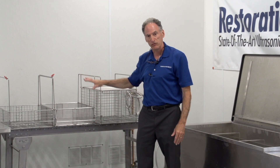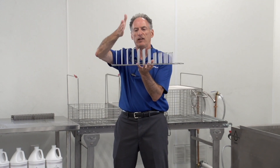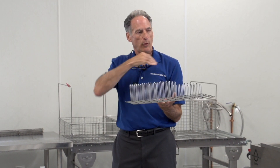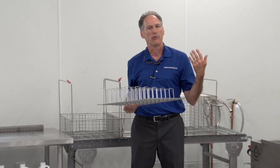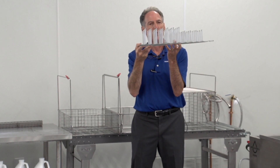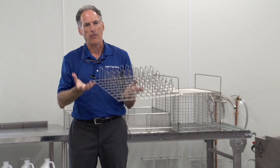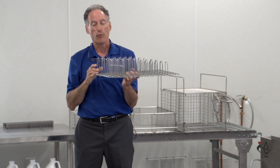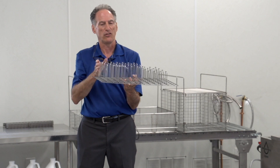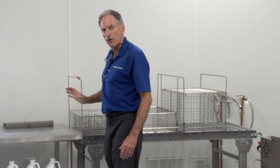Those are the three basic types of baskets. Some of the inserts that are possible — this is a dish rack insert. If you take a look, you'll notice it looks a lot like your dishwasher at home. It's a dish rack set designed to load dishes in. With an ultrasonic system, there's no need to have an external dishwasher — you can clean all your cups, dishes, and glasses in the ultrasonic process. However, this is not to be used with glasses standing upright. You'll want to lay the glass down, because as you lower a glass into the tank it'll fill with air and the glass will start to pop out or float. In order for ultrasound to work, you've got to get water into all the cavities. So this is perfect for dishes — just stack the dishes into the grooves. This dish rack set drops into each basket very nicely.